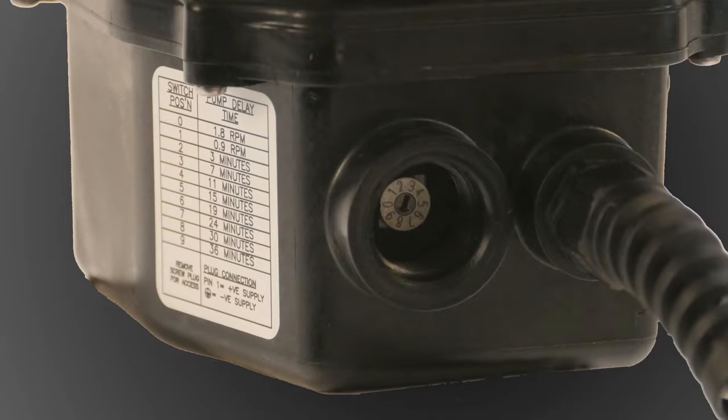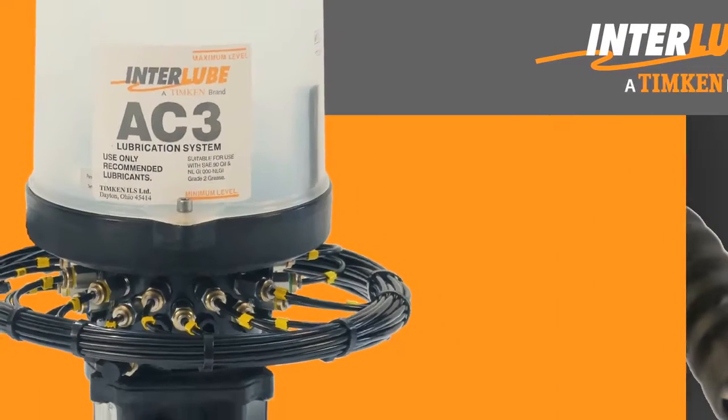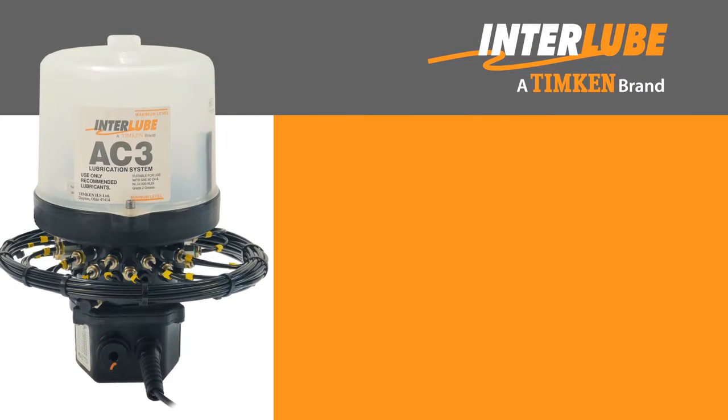The timer setting on the pump is preset from the factory to automatically grease the entire system every 30 minutes when the ignition is on. Although the timer setting is adjustable, the 30-minute interval has proven to be a reliable setting and generally does not have to be changed. To properly inspect your Interlube auto grease system, you will need to inspect the line connection